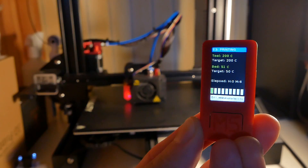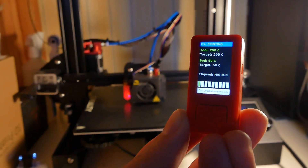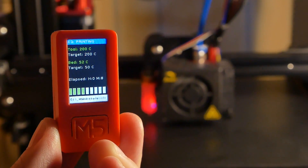I set myself a challenge to create something silly but impressive using only the visual interface. I wasn't sure whether I'd meet my goal, but I decided to make something I call a 'Print Stick' - a small device you can put in your pocket that displays basic functions of your 3D printer. For this I'm using MQTT to communicate with OctoPrint linked to my Ender 3 - which is a great printer by the way. All that data coming from MQTT is processed by the ESP32 and displayed on that tiny screen, which is awesome.